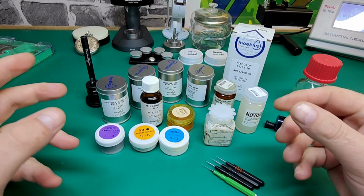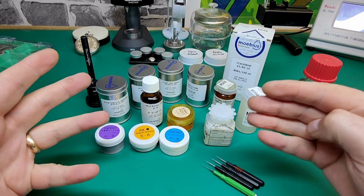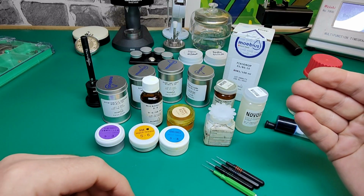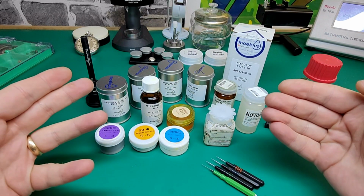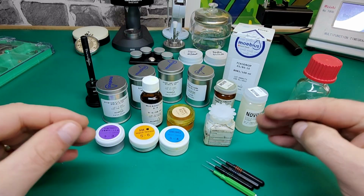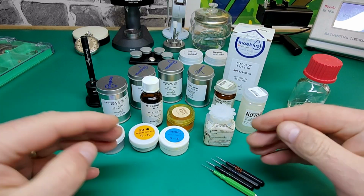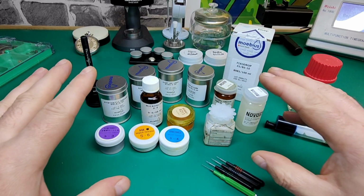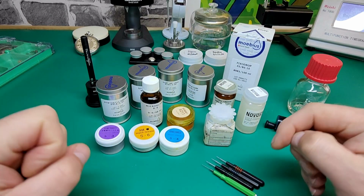And one thing I actually heard, but never mentioned in the first video, is quite a basic principle, but the question came up quite a lot in the comments of, you know, what oil do I use for this? What grease do I use for that? And one of the basic principles to remember is that if it spins, use an oil, and if it slides, use a grease. It's a very good basic principle to apply to lubricating something, including watches. It's not a coverall. It doesn't mean that absolutely in every single watch ever. But as a good general guiding principle, if it spins, use an oil. If it slides, use a grease.